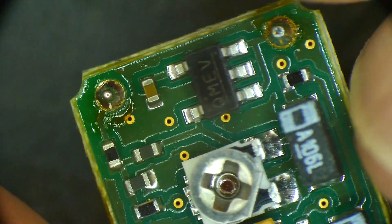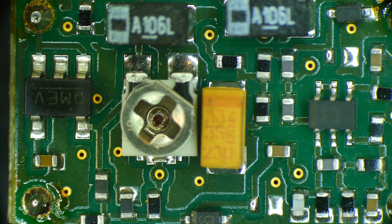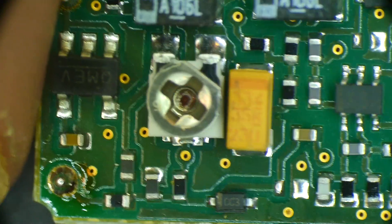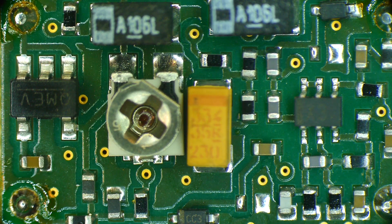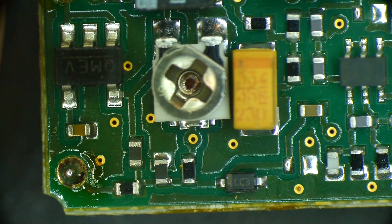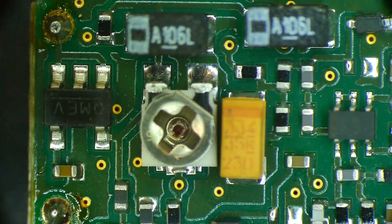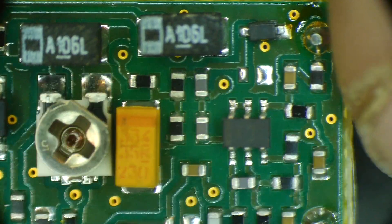So my question to you guys is: what is this thing? Do you have a datasheet for it? My best guess is that it's a programmable device, and this is actually phase-lock-loop stuff on the back. I'm assuming the microprocessor handles some type of division, and it ends up being a programmable PLL, so pin 1 is probably a serial input — you talk to it and tell the microprocessor what frequency you want.